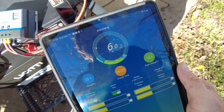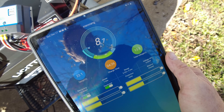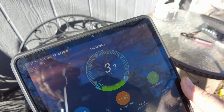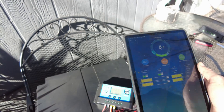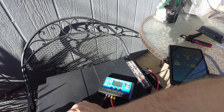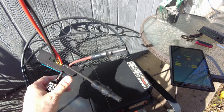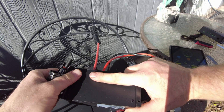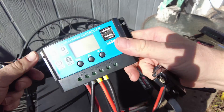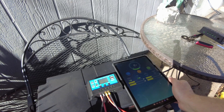We're back up — now we're at six amps. It came out blazing but then just dropped like a rock. I want to disconnect the solar and see if it just restarts. I'll disconnect the battery too and give it a chance to fully restart. It feels really hot right here — a definite hot spot where I didn't feel that on the Renogy. I bet this thing got hot real quick and then throttled down.